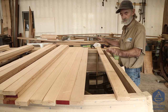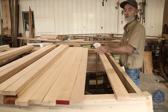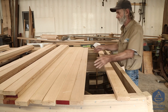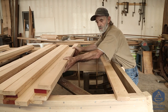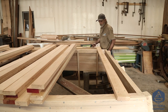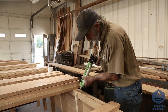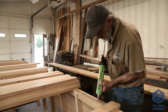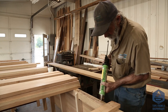We've got our first plank screwed right down into position, and we're going to use that plank to clamp all the other planks up to it — five more planks at a time. First we just stack these planks up and get them out of the way so we can move around the side and spread some polysulfide along the chine logs. We'll put maybe five beads on there, a little bit lighter than we did on that first plank, so we don't waste so much.